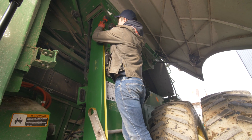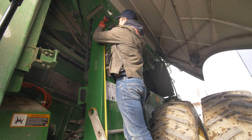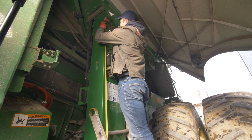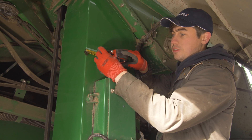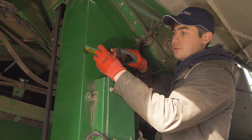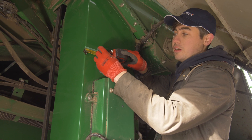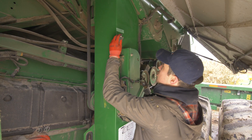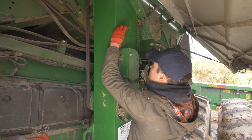For marking out the drilling location for the sensors, we are using the installation template and going 77 inches up from the bearing. We measured the paddles on this combine and decided to go with 2 and a half inches so that we were lined up with the center of the paddle for our drilling location. Once you've got your drilling location marked out, make a mark with your center punch.